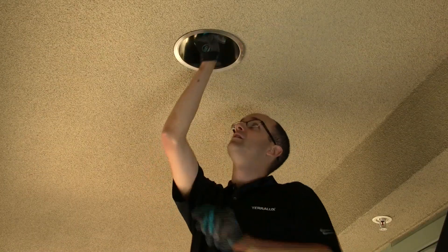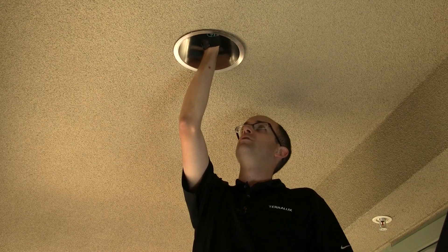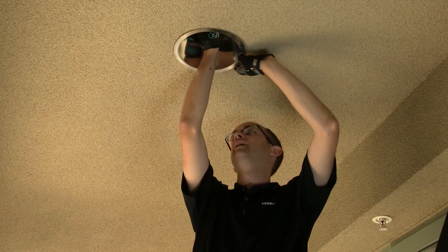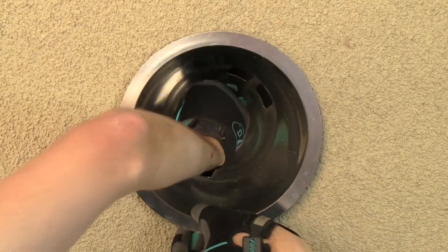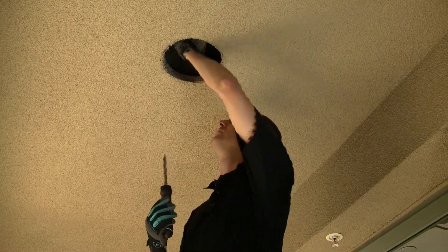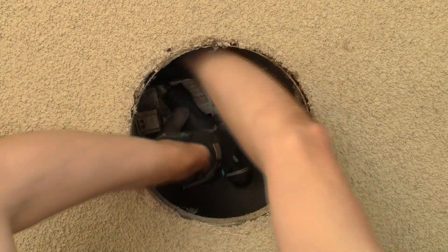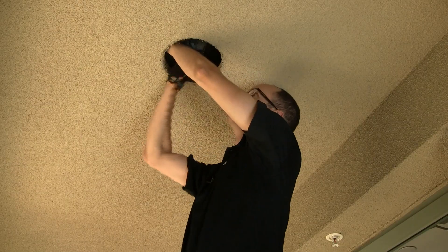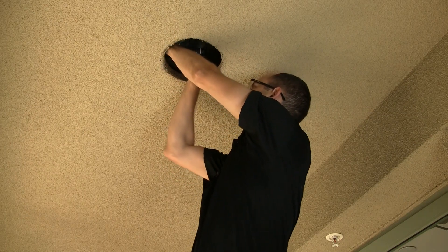The next thing is a wing nut here holding the trim in the ceiling. What we're going to do is reuse the existing trim so that we don't have to damage this nice stucco ceiling, and it speeds up the installation because there won't be any need to paint the area around the trim. Once you remove the trim, you'll disconnect the three wires from the existing ballast. I'm going to unclip the ballast here — I have three solid core wires plugged into the back of the existing ballast. Using a slotted screwdriver, a very small one, I'm going to unclip these wires from their poke-in connectors.